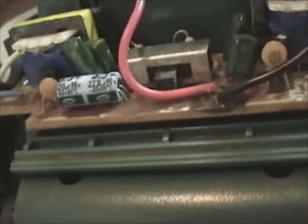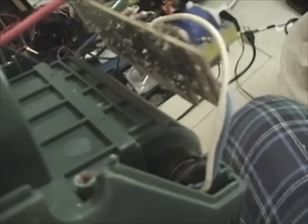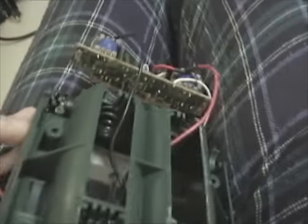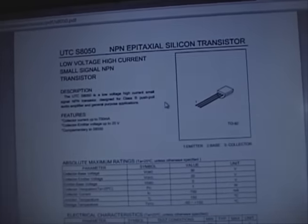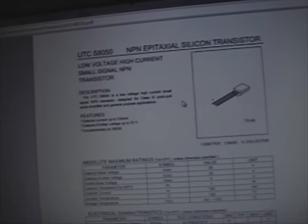You can see the job I did soldering wires on for power with heat shrink tubing - did a half decent job on that. The circuit board looks horrible underneath - can't believe I paid eight bucks for this, although I did get two very good lamps so that was pretty much worth it alone. Before I've even started I've hit a snag - I assumed these transistors were 5609s but they're not. They're a type I've never dealt with before: S8050 transistors. Looking online, one website claimed they were PNP transistors but everything else says they're NPN so I'll assume NPN.